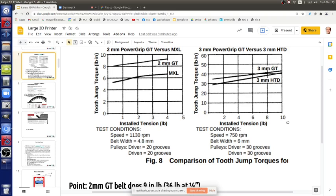With GT2 belts we were getting about half of what the motors could pull. The new 3-millimeter pitch HTD belts give 30 to 40 inch-pounds, meaning about 120 pounds at the quarter-inch radius. These belts should not be skipping. We observed that when the axis was stuck, the belt wasn't skipping - the motor was skipping because it didn't have enough force. So belt is not the issue. Friction is.